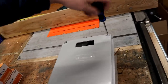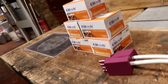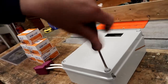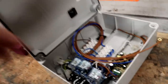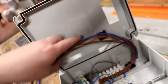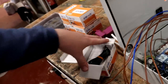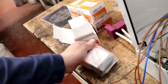Apart from the STC-1000s, which you can see — the authentic ones sitting there in the boxes waiting to be installed — all I have to do is pop out a couple of screws, open the box, and you can see everything is in here ready to go. Still with loads of bits of glue. I've even got the wires here ready to hook around to the STC, so we just need to fathom what's what with a multimeter, pop one of the STC-1000s in there, and these little fellas are ready to control our five new fermenters.